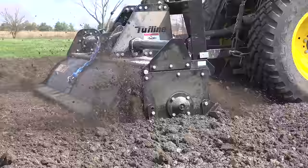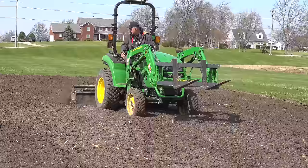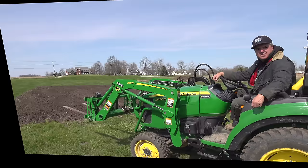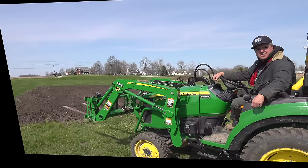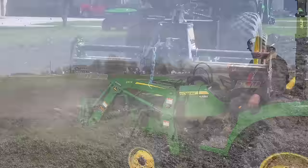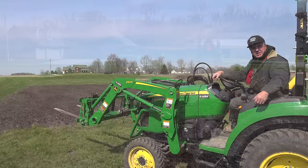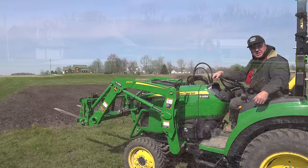At this point, you can see that I've given up on tilling shallow — I just socked it in like normal. So much for that. I guess you can't teach an old dog new tricks, at least when it comes to me and a tiller. When I tried to set it really shallow such that the three-point hitch held it up, it was not floating on its skids at all — it just went up and down really bad and left waves in the ground. I've seen that with my other tiller as well, so it's not unique to this one. I really saw no choice other than just let it down on its skids and let it float.